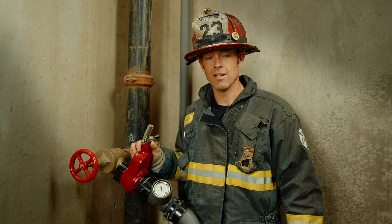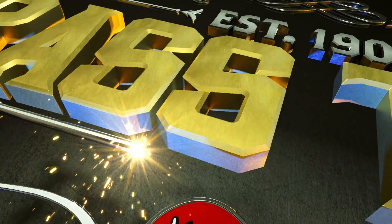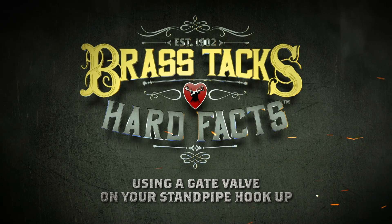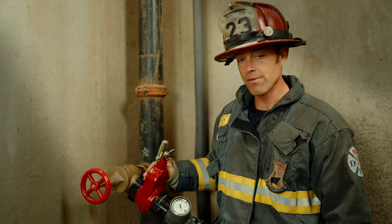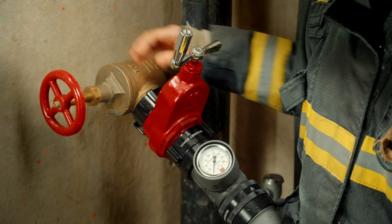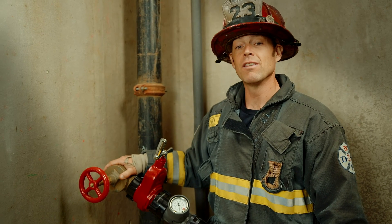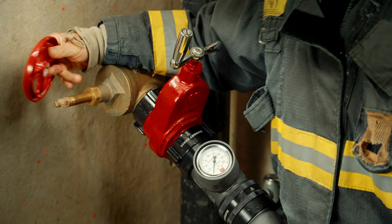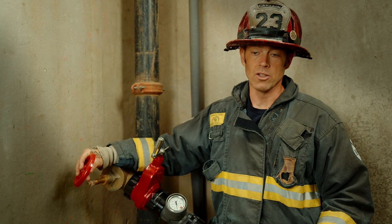I'm Eric Toland. We're getting down to the brass tacks and hard facts of using a gate valve in your standpipe hookup. Many firefighters may ask, why are we putting another valve on top of a valve on a standpipe? This is a key piece, because we put a lot of faith in this standpipe outlet that may have never, ever been used before. What if that wheel falls off? What if it breaks, or that outlet itself seizes as you're flushing and you need to shut it down again to then make the hookup?